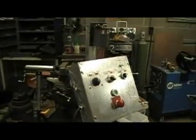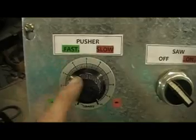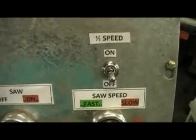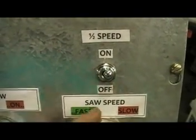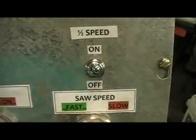So the controls — we mounted them on a podium so the podium can be moved. We'll eventually bolt it to the floor through that plate. There's our cord bundle which we'll tape up when it's in its final location. The pusher is on a dial so we can change the speed of the pusher — basically zero to about four or five feet per minute. The saw is just on or off, and we can also control the saw speed with the inverter. We also added a safety device: if we see a nail coming up, we flip this switch and instead of having to dial it in, this will immediately cut the frequency in half, making the saw run at half speed — somewhere around 500 feet per minute.